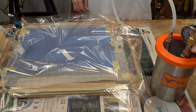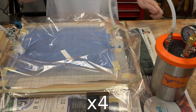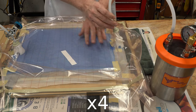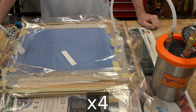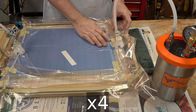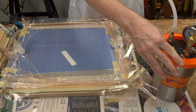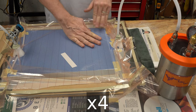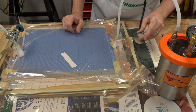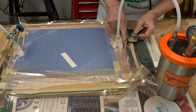With the vacuum pump running, it's time to crack the valve leading into the resin trap so we can start drawing a vacuum on the vacuum bag. I try to remove wrinkles that are directly over the part. Once I'm fairly happy with the wrinkles, I open the valve the rest of the way and pull a vacuum, then start checking for leaks. One of my viewers suggested using a stethoscope to check for leaks, so that's what I'm doing here — it worked reasonably well.